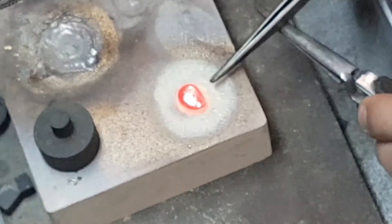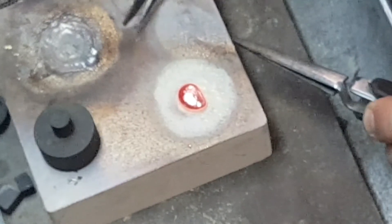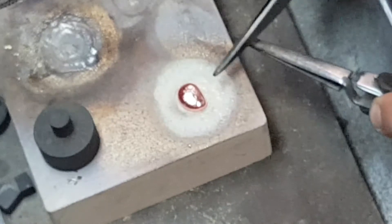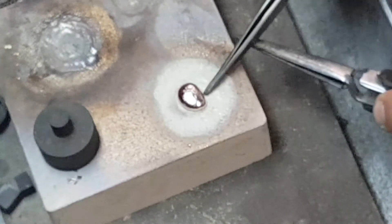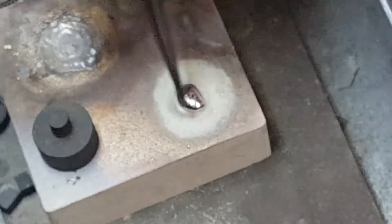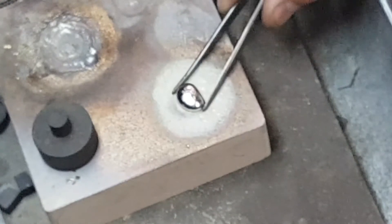Now as you can see here, I'll wait for it to cool a little bit — it should actually crack free. The metal will sink down and melt into the ceramic crucible. This isn't a platinum melting crucible, but suppliers around here don't have any at the moment. Platinum expands and contracts with heat, so as it cools the piece becomes smaller and cracks free from the crucible. On larger melts, the piece will actually crack and jump off as it cools, which is pretty cool. There we go — it's come off.